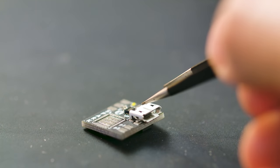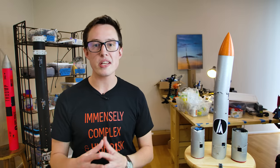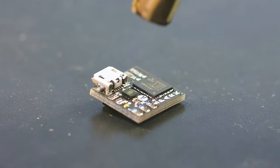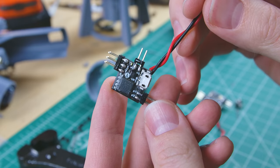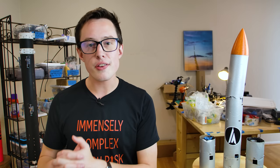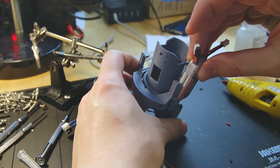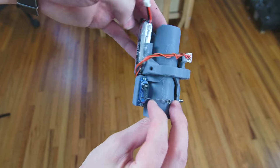The front of the board also has a bulky USB port. You could get rid of this with some pogo pins or some other solution, but for me it made programming a lot easier. Once all the parts are applied, it's time to do the melt. To make it easier to use, I soldered header pins off of the sides of the board. One of the coolest parts about this board is that it is so small you can mount it on the thrust vector control mount of the rocket. We can pick a spot for the flight computer and the battery in the TVC mount, and basically this unit is an entire self-contained stage of a rocket.